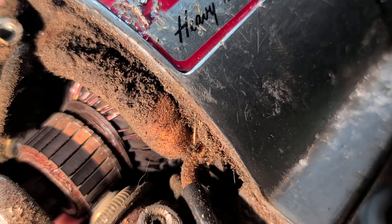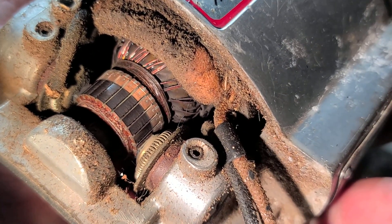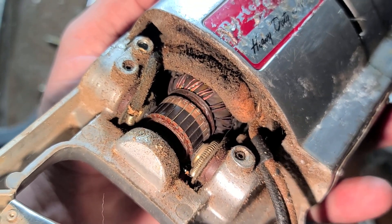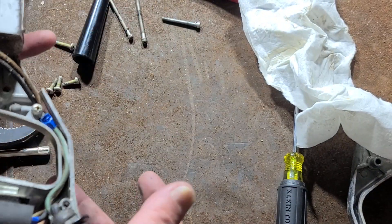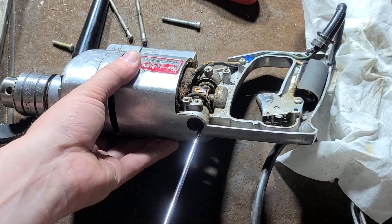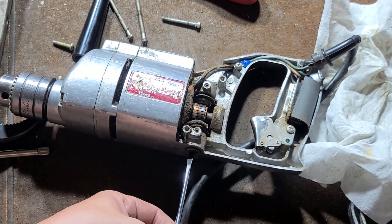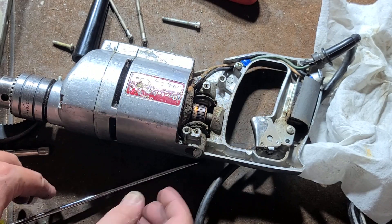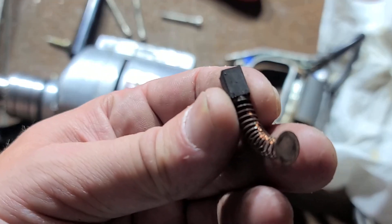Here's the classic motor design — we can see welded contacts, pretty well guarded motor, wrapped field. Motors really were built a little bit better in the old days, just because once again they wanted to make sure that they really lasted, until they learned that they could just use crimped fittings and just a little bit of epoxy and they basically last about as long as the much more expensive older school motors. Pull out these brushes — they still have some life left in them.